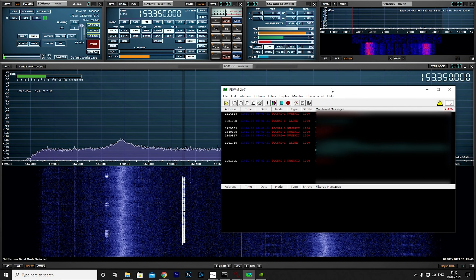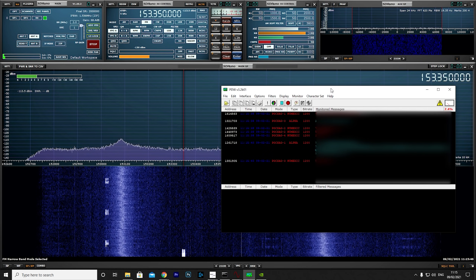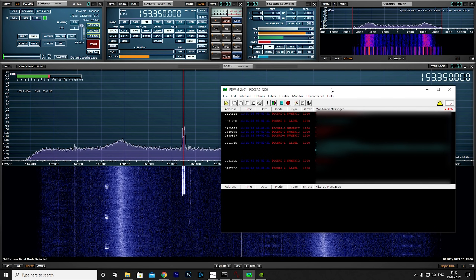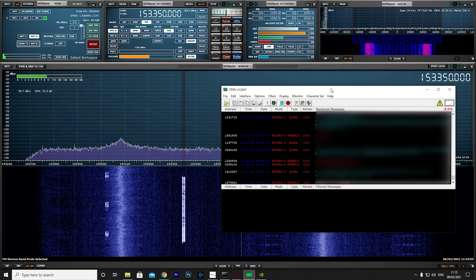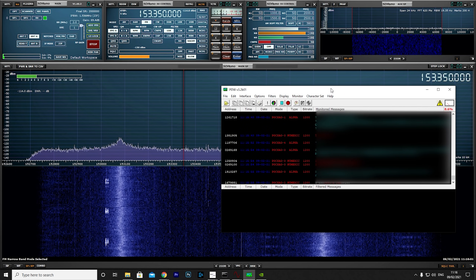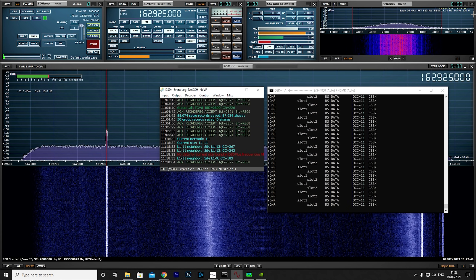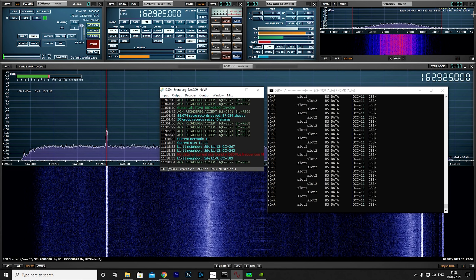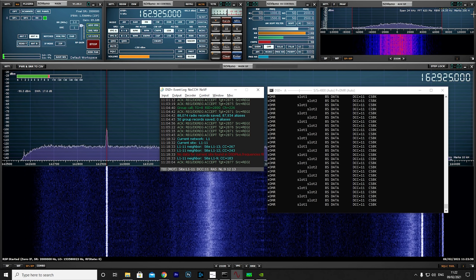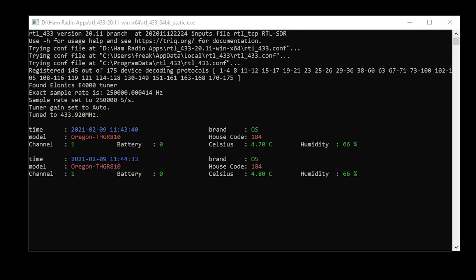The first test will look at the middle of the VHF band around 150 MHz. What we find here for my location are POCSAG transmissions — in other words, pages. I'm not entirely sure where these transmitters are located, but when using my external collinear these signals are actually off the scale in receive strength. I'm using PDW here to do some decoding. Next up is a push-to-talk service located around six miles away, and DSD Plus is actually able to get a good lock on this service.